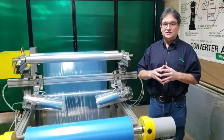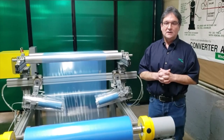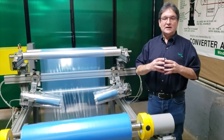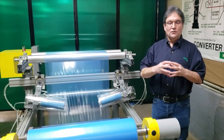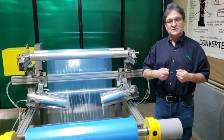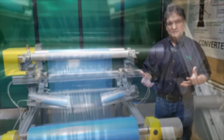As far as your web is concerned, it's just like any other idle roll in your machine. The way it works is it has a rubber sleeve that stretches as it rotates. The material enters on the contracted side of the roll and exits on the expanded side. As the roll is rotating, that rubber sleeve is constantly stretching underneath the web, and that's what pulls the wrinkles out.